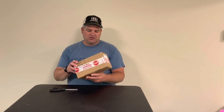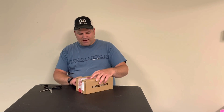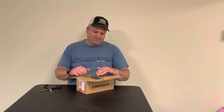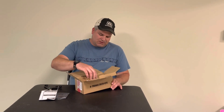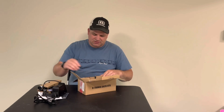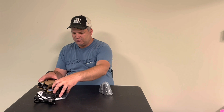The first thing I got here is a new soldering station from Amazon, made by a company called Xtronic. I haven't even opened it yet, so this will be the unboxing. It's not very expensive — it was about $55. I've always wanted a soldering station. I use a soldering gun for most things, but when you do precise soldering, a gun is too big and bulky and makes too much power for fine work.